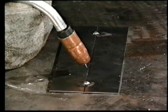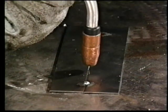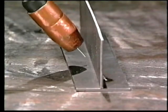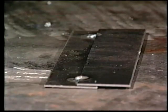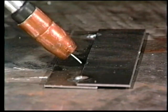The second angle, the work angle, is determined by the joint design. For example, when you're welding a butt joint, the gun should be held so the angle is 90 degrees to either side of the gun. To weld the T joint, the gun is held so the angle is 45 degrees to either side of the gun. On a lap joint, the weld is made at the point where the two pieces of metal overlap each other. It's best to aim the gun slightly more at the top piece so it will receive the same amount of penetration as the bottom piece.